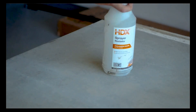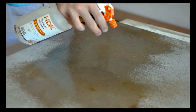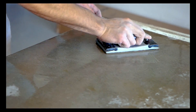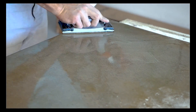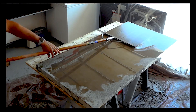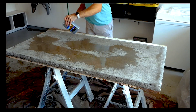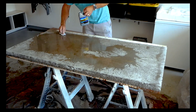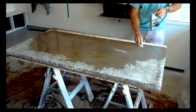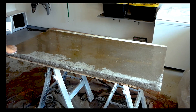Personally I'm not a fan of wet polishing countertops because it opens up far more pores and creates voids you've got to go back and patch. Instead, the simple solution for me was to get a sanding block with wet-sanding sandpaper — 1,500 grit — and a spray bottle, and do my own manual version of wet sanding on the countertop. Keep in mind it's not going to give you that glassy, smooth granite feel, but this is concrete — it's supposed to have some rough texture. With the sealer it comes out really well. I used Sealer's Choice Gold from Home Depot; just pour it on top and leave as much as you can for the concrete to absorb — it works like a sponge.